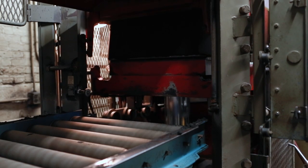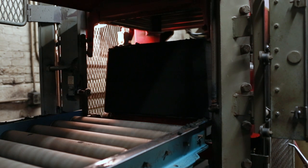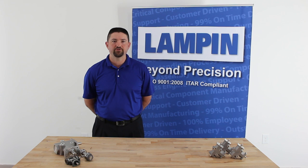The pattern is pressed into the sand, creating the cavities for the gearboxes and the runners for the molten aluminum. The core is inserted into the mold and the two mold halves come together to create one completed mold.